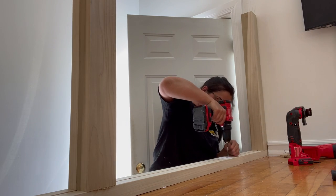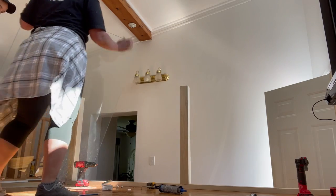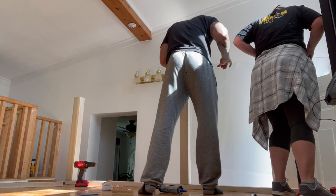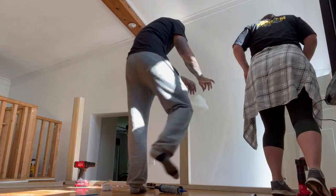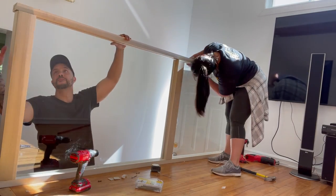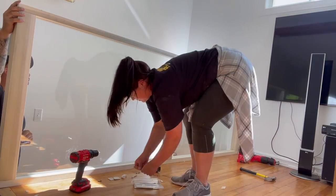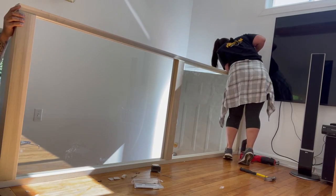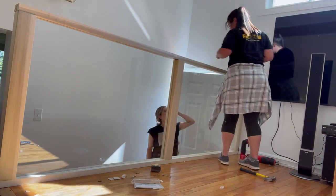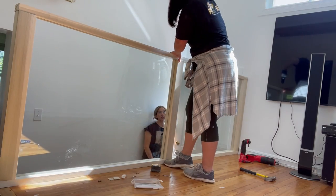The glass completely hides the screw heads. I dry-fit the glass first just to make sure, and once it fit I put a bead of flexible clear adhesive in the relief cuts and set the glass inside. I did the same with the top rail and added adhesive to the tops of the posts where they met the top rail as well — you might need a second hand for this. I then used the same small-head GRK screws to screw the top railing onto the posts and filled them with wood fill. The smaller the screw head, the better it looks wood-filled, in my opinion.